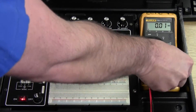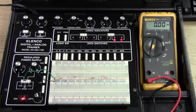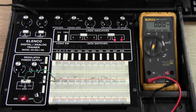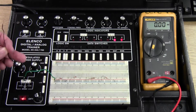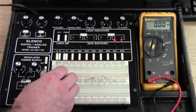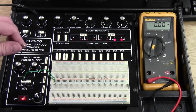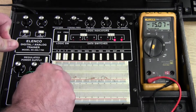Now to measure current through each branch of the circuit. I've already calculated this circuit and I know the total current is less than 300 milliamps, so I won't need the 10 amp setting. To measure total amperage, I'll break the circuit by removing the ground wire — that spot is common to all four resistors and all four branches. I insert my spare wire into the same spot and go from one lead to the next. I've got 15.07 milliamps.